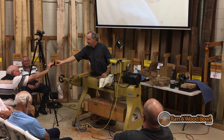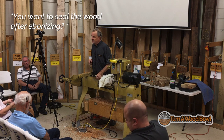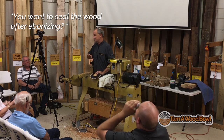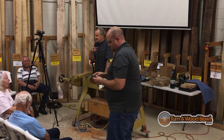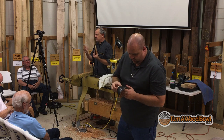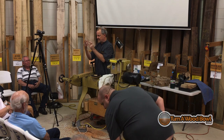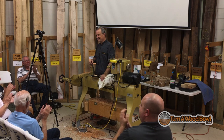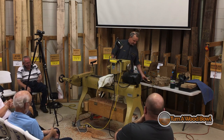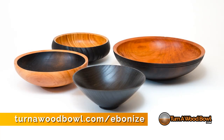If you want to use the ink on a thin bowl, seal it with shellac first. The only issue I had was it bled through the thin end grain because it was so thin and the end grain soaked it right through. For a thicker piece with Indian ink, you wouldn't have to seal it — just paint it right on. Check out the website — I've got all this information, pictures of all the steps, and you can learn more about it there. I also explain how to do an ammonia technique, which I haven't done myself, but there are instructions there — it's kind of neat.